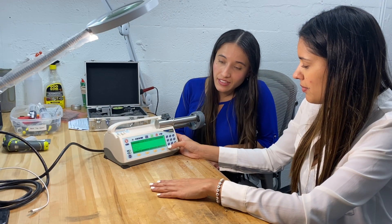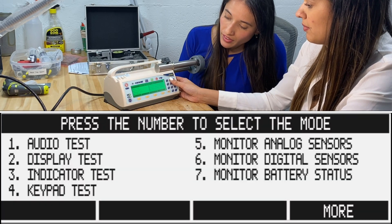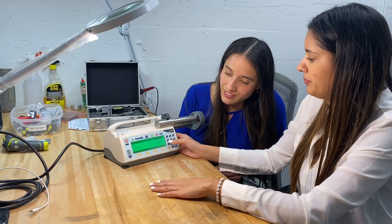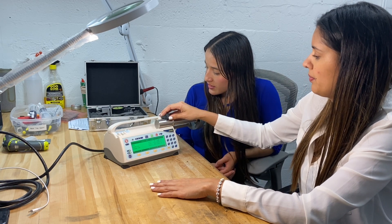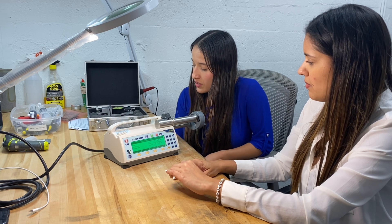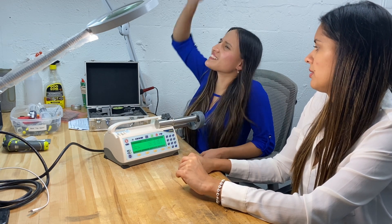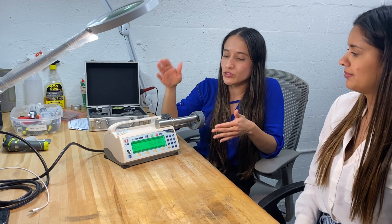Now we go back to diagnostics and to number five, monitor analog sensors, to verify the calibration. For the size, it should be between 1.244 and 1.260 — right now it reads 1.250, so we've done an awesome calibration. It's not that complicated as long as you have the kit and read the service manual.